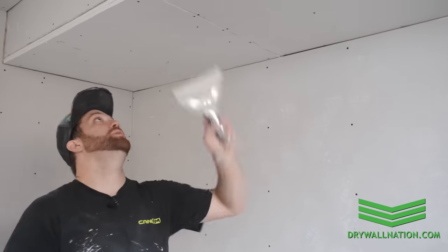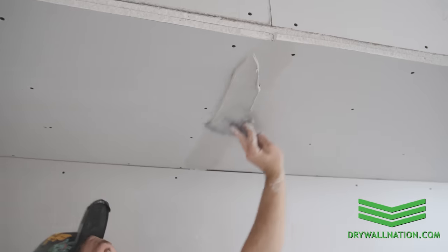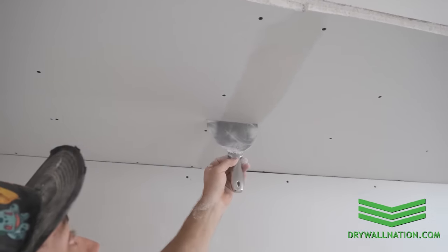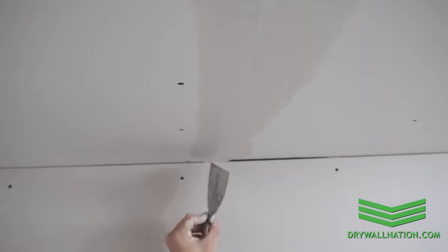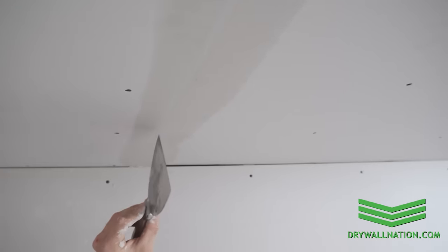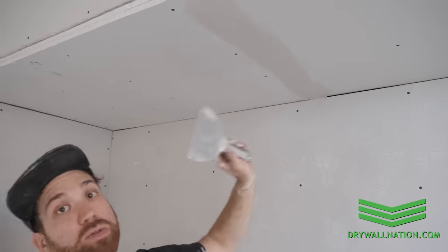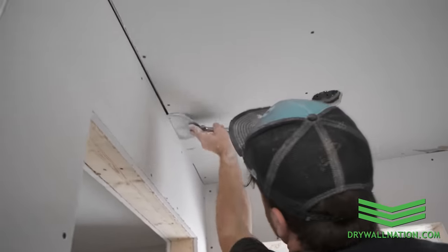Here's that same butt joint — really slap the mud in there. You can see now it's filled nice and flat, no humps. V-grooving gets rid of all the little fuzzies and burrs along there, as well as any peaking from the paper coming down. The joint is now nice and flat with a nice solid base coat, ready for taping. Along the top here you can see the sheet was a little short, so I'm just going to fill that edge real quick.